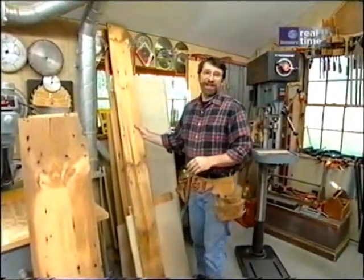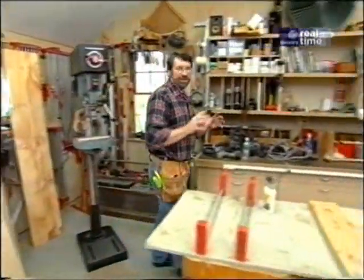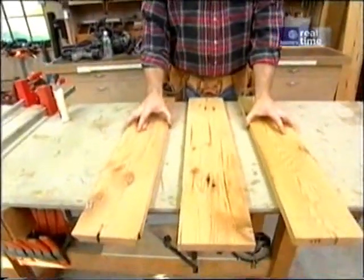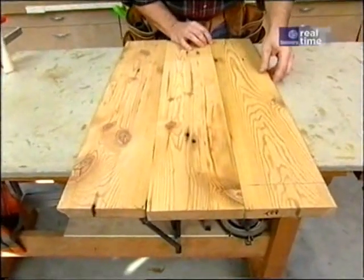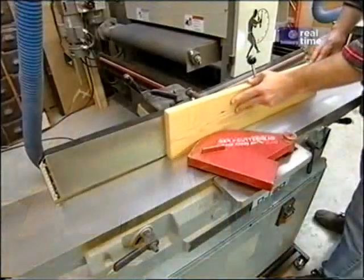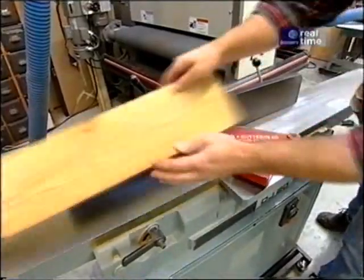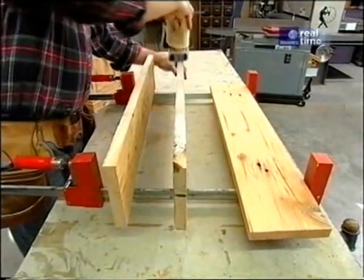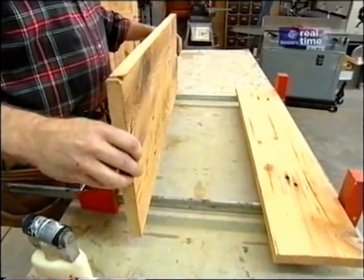It took me about a half a day to clean up enough boards to build the prototype. Then I cut pieces out of those, sometimes going around defects and some of the nail holes. Here are three pieces which will make up the top, and I need to do a glue-up. If I slide the pieces together, you can see that they're not quite tight and straight, but that can be taken care of at the jointer. I don't think I'm going to bother with any biscuits on these joints — these boards are pretty flat and they'll line up when I put them in the clamps.